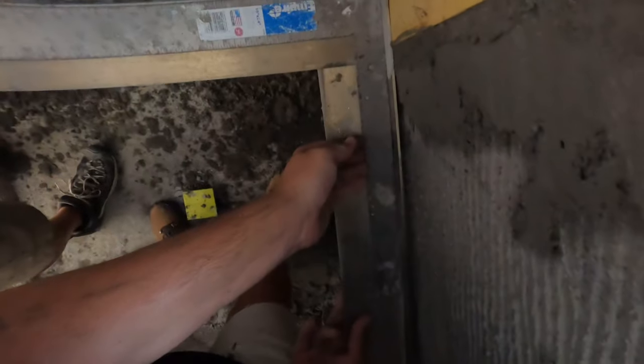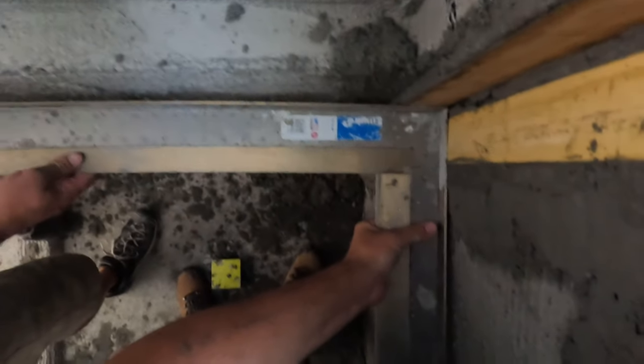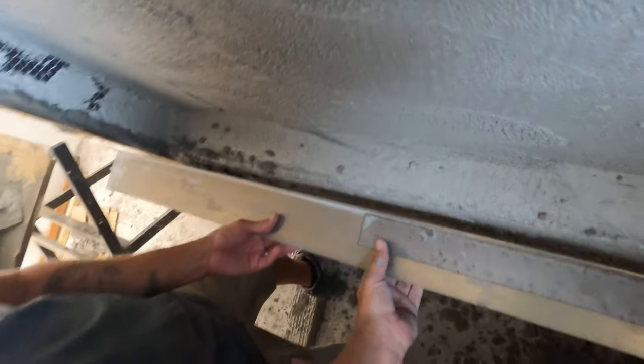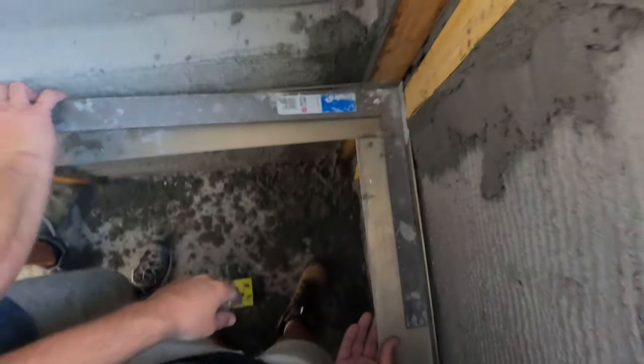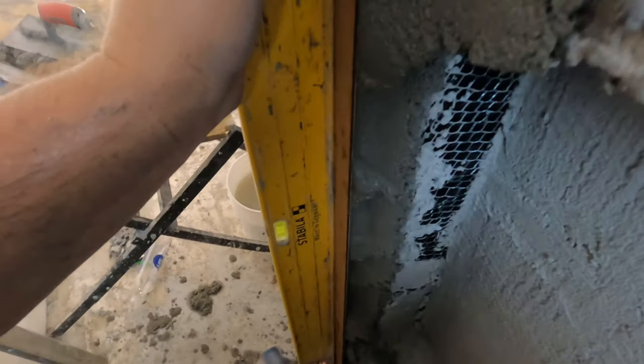Your stick is a little crooked there, but that's okay. Right, let's see what we've got here. It's got to come out a little bit. Well, yeah, we can try to tamp that in, but it looks like we need to come out just that little bit there. So I'll pop that stick, add a little bit more mud, we'll check it again, and we should be good. Yeah, that's pretty quick, just popping the stick. And now we will make it nice and plumb again.